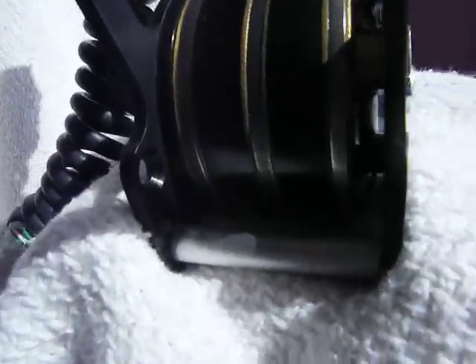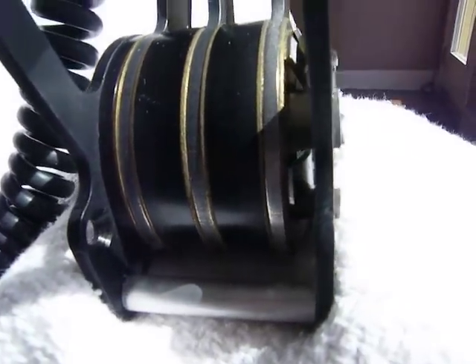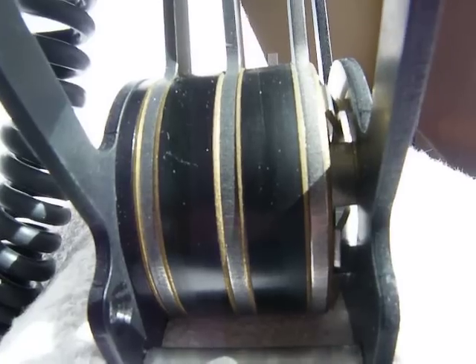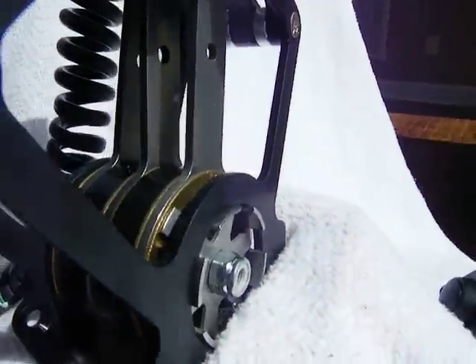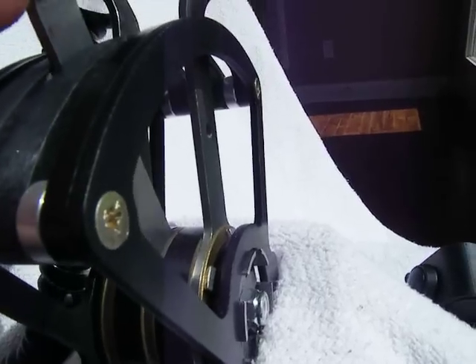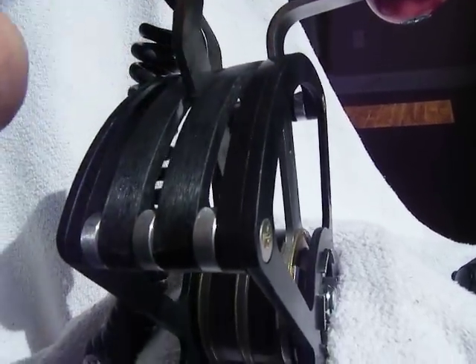At the base of each lever, it actually wraps around the drum — 5/8-inch wide cold roll steel wraps around the drum against these brass inserts. As a result, you've got a really high contact volume around the full fore-aft travel. So with any kind of pressure against the lever, you stay consistent with that amount of pressure. There's no sticking as the lever travels fore to aft.